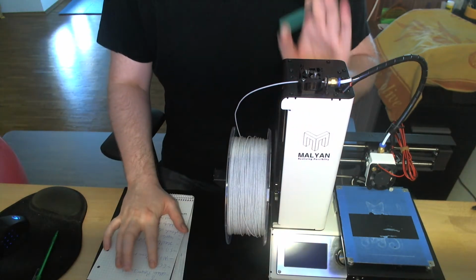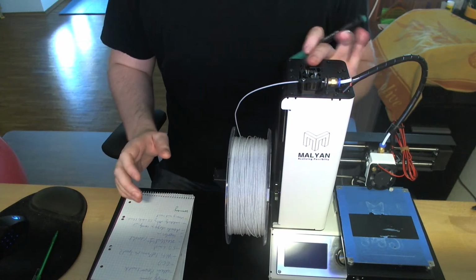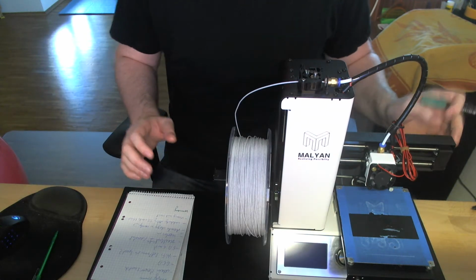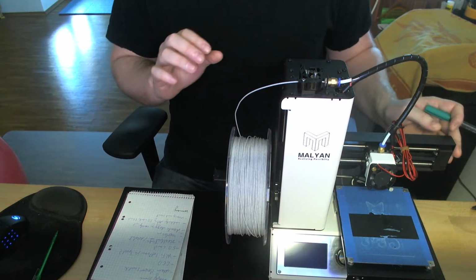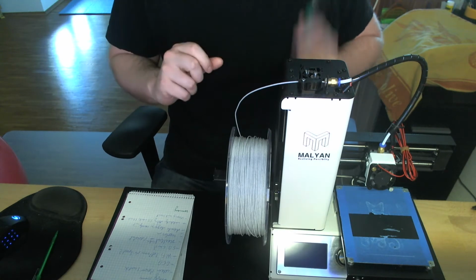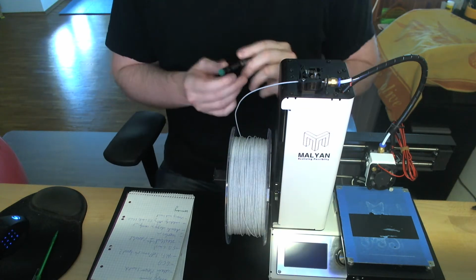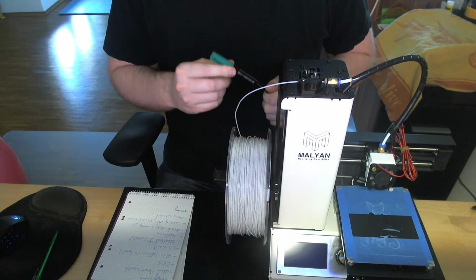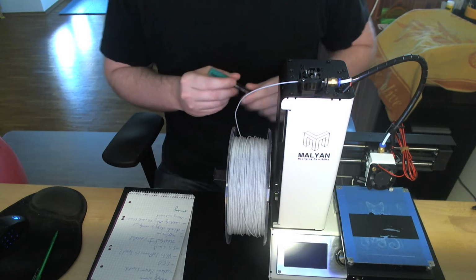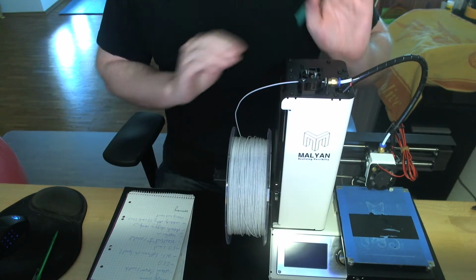The first thing I noticed when I took it out of the box was that the frame was wobbly. Not only a little wobbly, the axis, Z-axis I guess, I always mix them up, bent around 5 millimeters up and down. It looks and sounds quite solid. Most of it is aluminum and they use self-cutting screws. Well, aluminum and self-cutting screws, you screwed up. I had to replace about 12 screws.